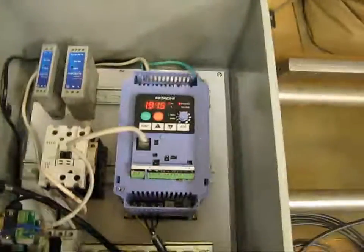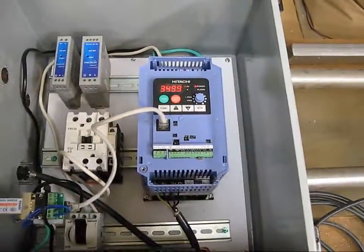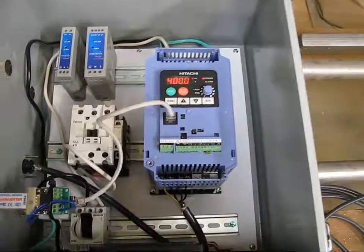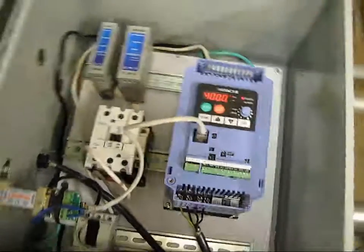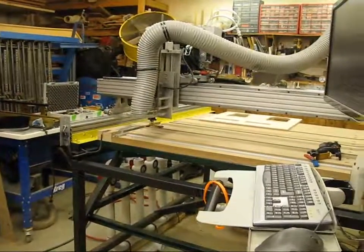You may have heard the little click — I plan on using the intelligent relay to drive my water-cooling setup only when the spindle's on. You can see the output on the VFD shows 4,000, which means it's running at full speed. The 15 seconds has passed, the machine is now moving, and as you probably heard, the spindle powered up.